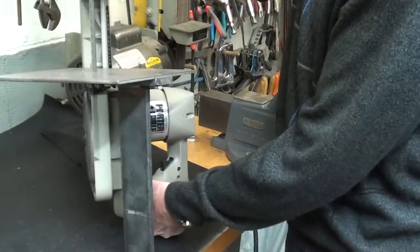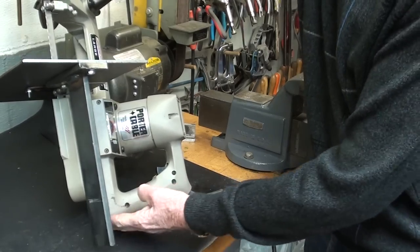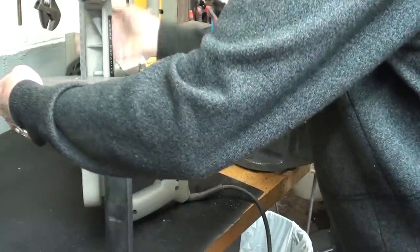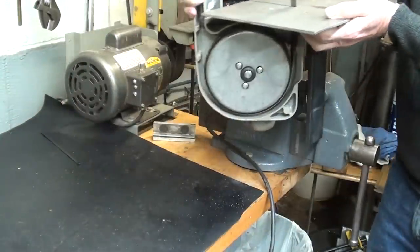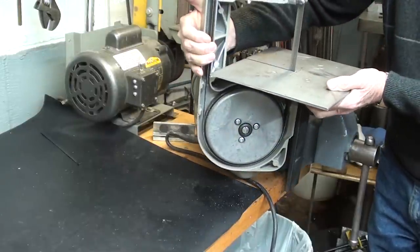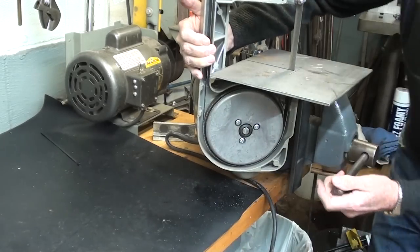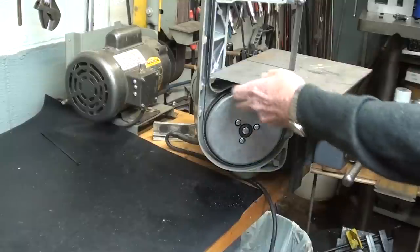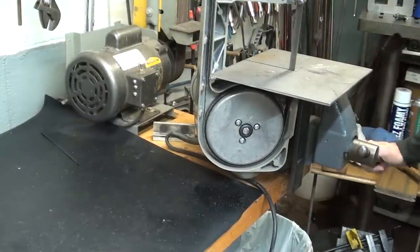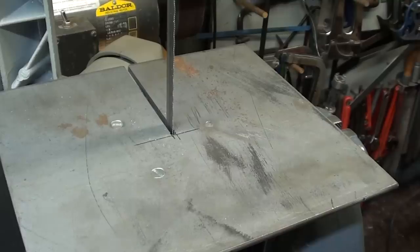I'm going to take the saw, and I would like some of the weight to rest right on the handle here. Not all of it by the bracket, but that can vary depending on the application. But this is going to go into the vise like that, and then again it's resting down here, and trying to make sure that it's approximately in the vertical position, that is plumb. And it's ready to go.